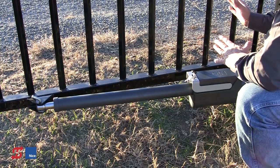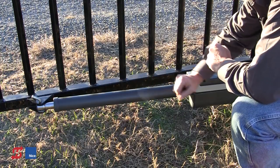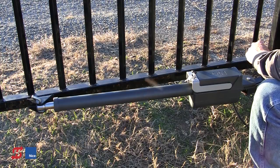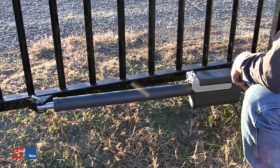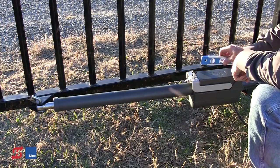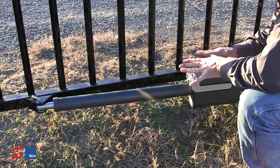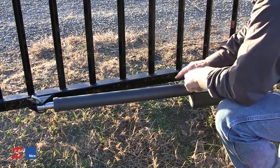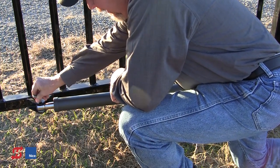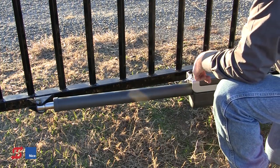We've opened the gate all the way to where we want it, mounted our linear actuator, and attached the gate bracket to the gate in that position. Because our pivot arm is level and plumb, and because we are a half inch below the center line of that structural member with our pivot arm, when we mount this operator it's going to be level. That's very important — we don't want the operator getting in a bind as it opens and closes. We should be able to remove the pin in the open position quite easily, which tells us the actuator lines up with the gate bracket and isn't binding.